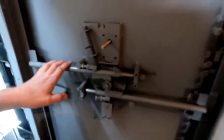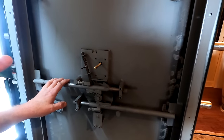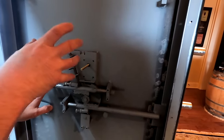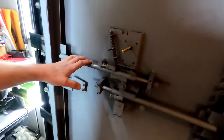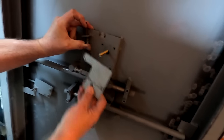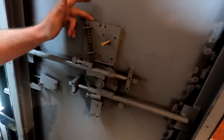What I like to do is thread the body in, get it bolted in, tighten everything down before I cut the spindle, and rotate the dial from the outside to make sure it's good and smooth. That'll let us know if everything is aligned properly. Now this is an important feature - this is called a re-locker. What the re-locker does: there was a plate that went on the back of the lock that, when loaded, holds a little roll pin. If somebody drills through the lock and knocks the back plate off, it automatically locks the re-locker - just another safety feature.